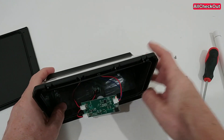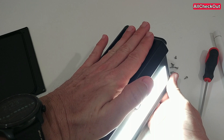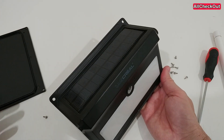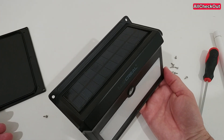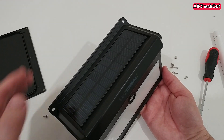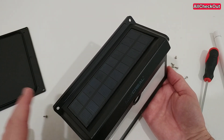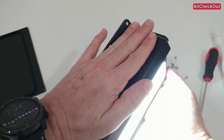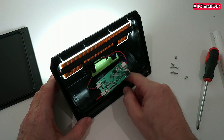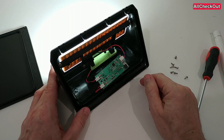I think in this situation, the switch is damaged or has a weak contact. What's very important when working with it: always make sure the solar panel has no light on it, otherwise it won't work. These lights only work at night — they don't have a built-in additional sensor; they only detect whether power is being generated by the solar panel. Even the low voltage from indoor light can interfere, so you really have to totally protect it from light.